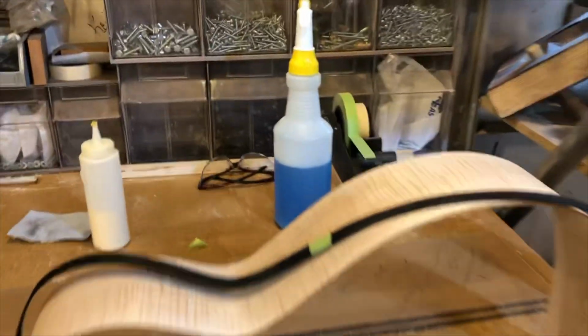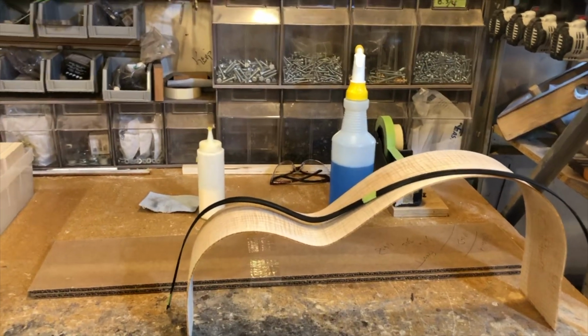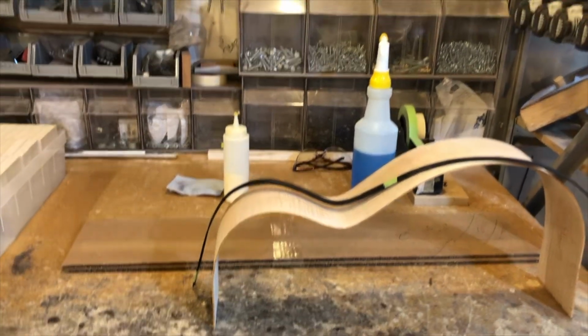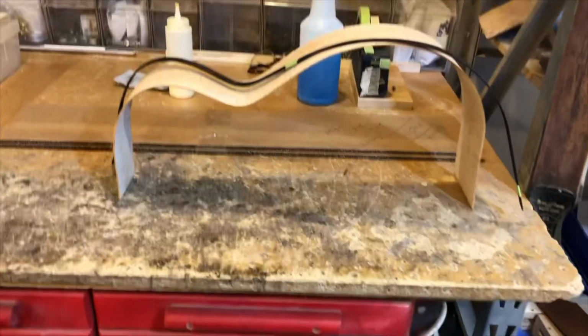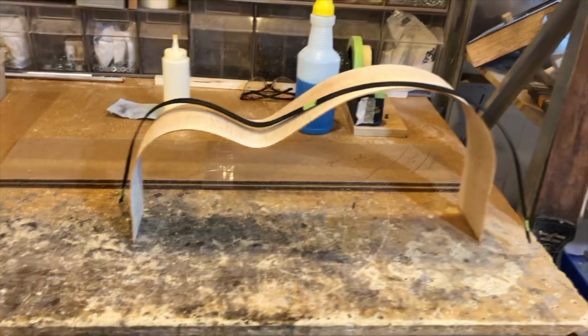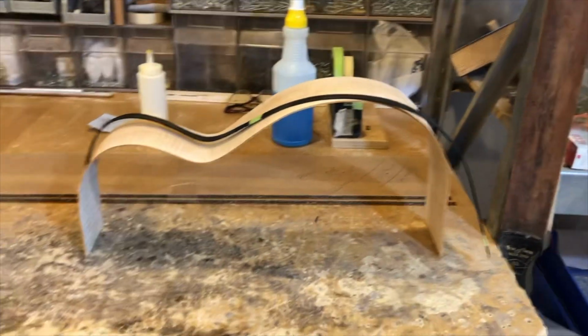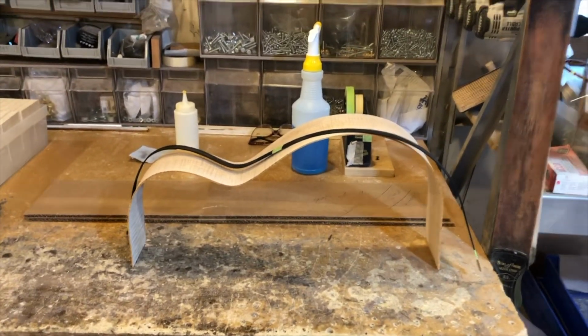So, figured wood, I'm just going to say normal moisture. I did go a little bit hotter on the maple. And with the double cycle, I made sure that I got the water out the best I can. And I was very pleased with the result. And the next time I bend something, we're going to put together a library of wood and temperatures.